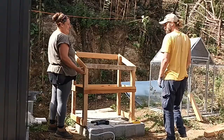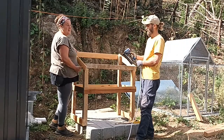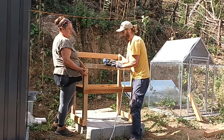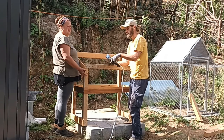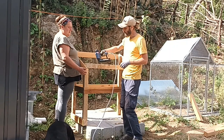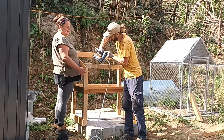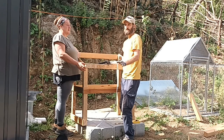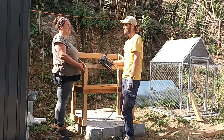You had some tips, right, yesterday about not shooting yourself in the finger. Yeah. You want to tell our viewers? The length of your nails, these ones are 55 millimeters. And my tip is never hold your non-trigger fingers closer than at least the length of the nails. Because these ones are super thin and they can just do a 360. It goes in a knot and it can come out here, it can come out there, or it can come straight up. It's very unpredictable with these needle guns, so be careful. You've done this before? Yeah, once shot myself in the finger, you only do it once.